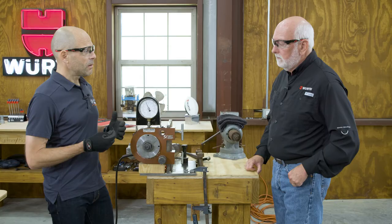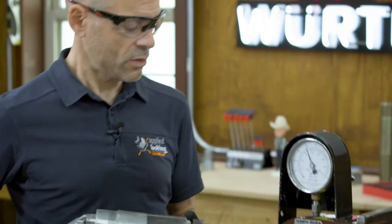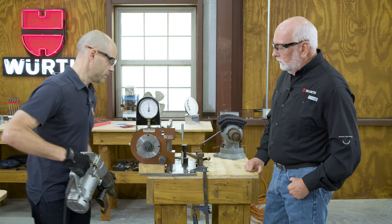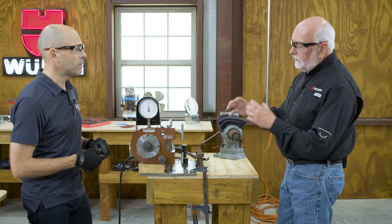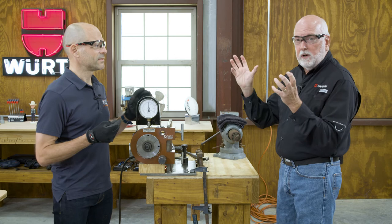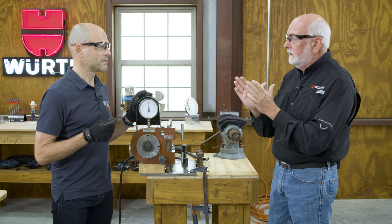Up in the structure, we want to compress it more. We're going to tighten it until the feeler gauge is refused in at least three spots or more. And what did our load end up being? We're at 47,000 to 48,000 pounds of tension. So the idea was to make sure we had an open DTI — the bumps didn't compress at 41, so it's strong and rigid — and that it will indicate or flatten out above 41,000.